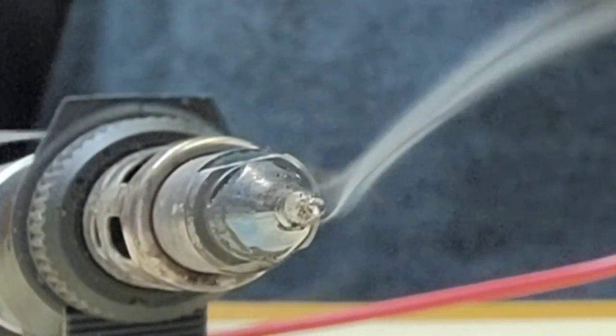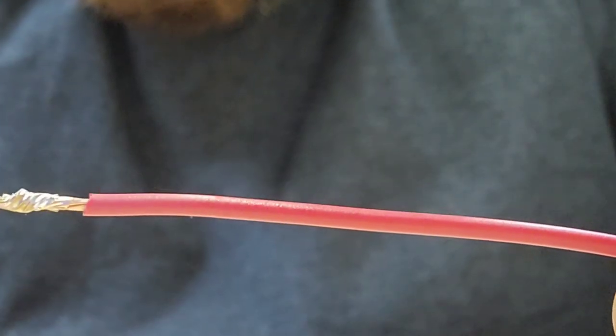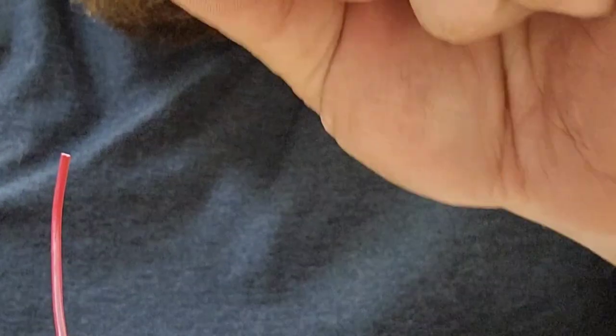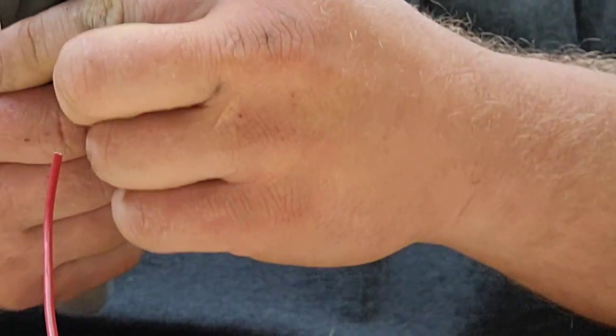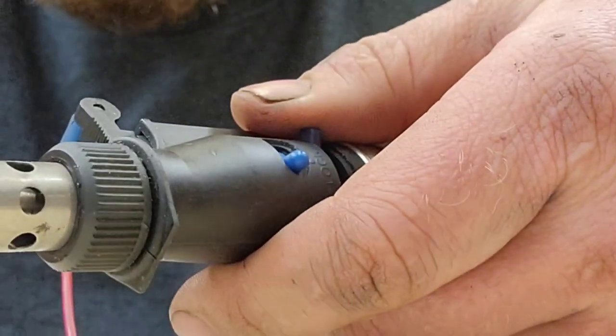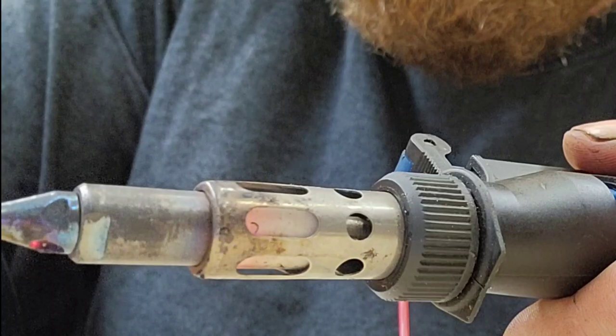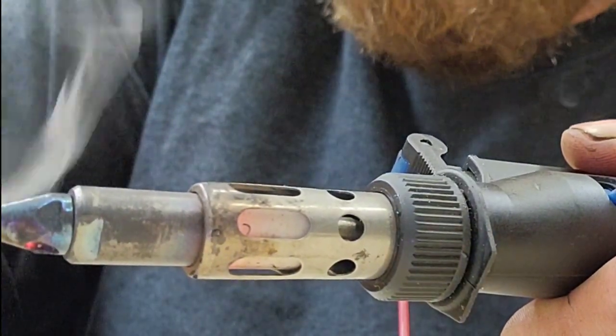The joint flows — we've got a solder joint now. With just that little bit it concentrates so much heat on that tip, so quick. If you just take a little bit of solder before you start — everybody doesn't have to do it this way and not everyone will agree with me, I really don't care — you take a little bit of solder and just hit that tip up just a little bit, get a little base built up right there on that tip.